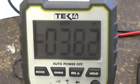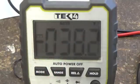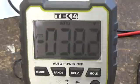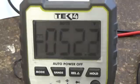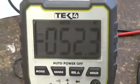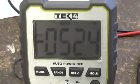The amp is plugged in and turned on. At the knob's minimum setting, there is a negative 38 volts of grid bias. At the maximum negative grid bias setting, it goes up to minus 52.3 volts. Hopefully within that range will be the value necessary to set the proper plate dissipation for the 6V6s — that's what we'll check next.